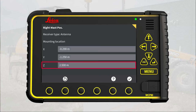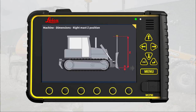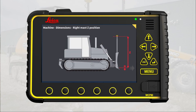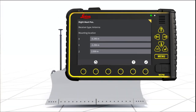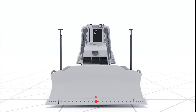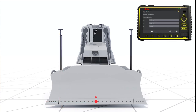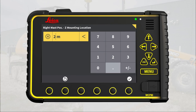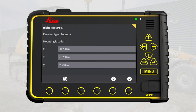Now on to the z value. If you have any doubt about where to measure, press the question mark — then press the measurement and a picture will show where to measure. Remember to measure vertically, parallel with the z-axis and not diagonally. We recommend using a Leica cross laser or a spirit level to provide a horizontal line from the reference mark along the mounting bolts, and then measure the distance between the top of the mast and the reference line. This time the distance is 2.5 meters. Press here and enter 2.5 meters. Now all distances are measured for the right mast.